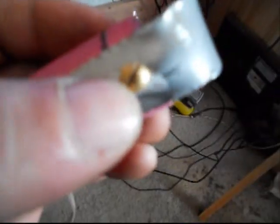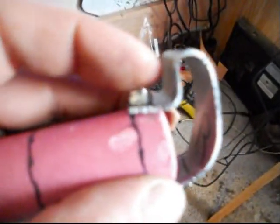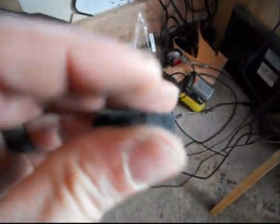Okay guys, so here's the foot. We've got it bolted. I used a brass bolt so it won't rust or corrode, and a nylon lock thread nut. Once I got the bolt through, I still had about that much extra, so I just cut it off with a pair of dykes, filed it down real quick to break any sharp edges. Then on the inside, if you notice, it's got a black dot in there. That black dot is this material. This is a very squishy neoprene foam rubber.